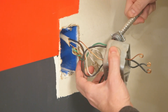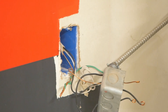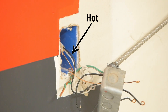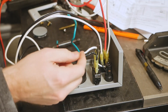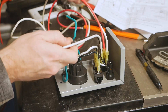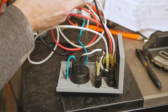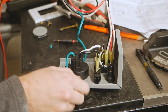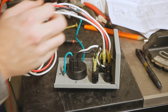At this point we should have two cable runs present: one from the panel, or the line power, often Romex, and one going to the furnace, often MC or metal-clad cabling. It's really important to remember which is which. As always, black represents your hot, white represents your neutral, and green or bare copper represents your ground. Inside the new switch we have several pairs of conductors: the top red and white set ties into your building's wiring (the line), the middle black and white set feeds the furnace (the load), there's a green wire for grounds, and the bottom pair is already pre-wired to the generator inlet plug.